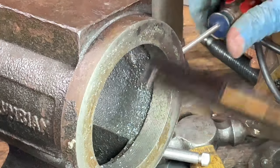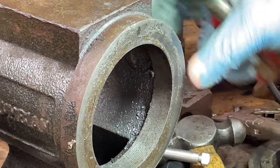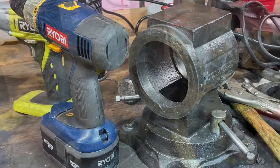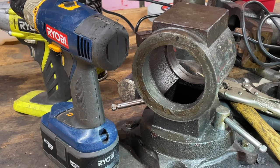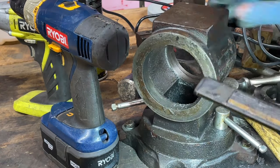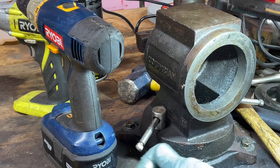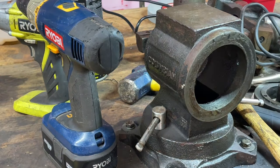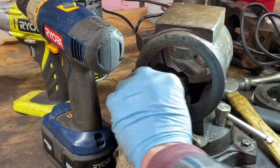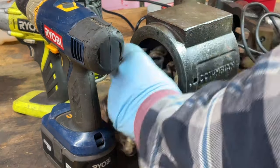If somebody doesn't want to go in, it's kind of hard. Maybe I should be able to get it to go in because this outside is clean now. I'm going to clean that up. And boom, goes the dynamite — we got it. I was able to use that broken-off piece of drill bit to thread it through. The only thing that fell out was the drill bit. Maybe it's down in there. It looks like there's still some threads there — let's figure out a thread count, and if I have a bolt, we'll make this work.